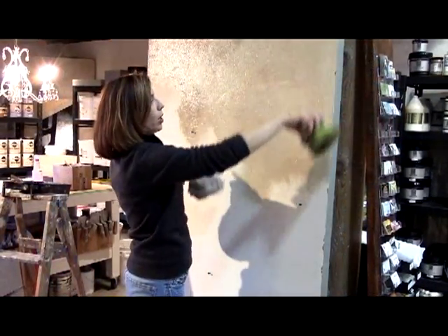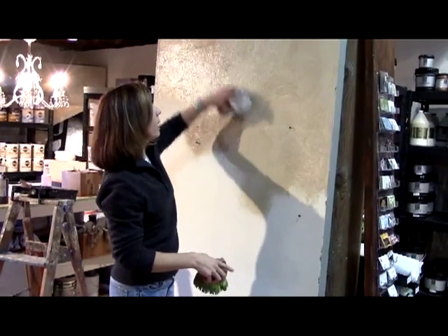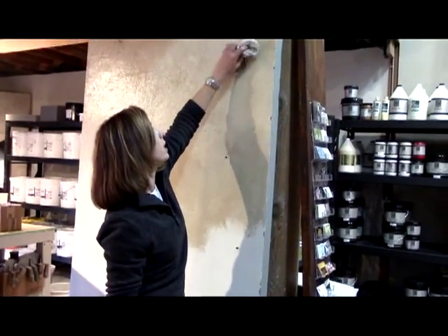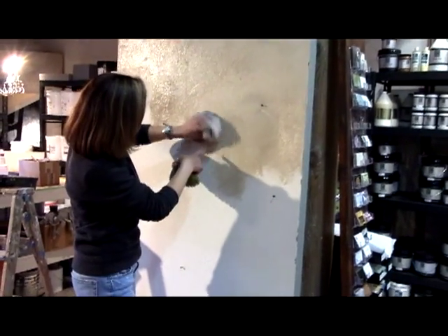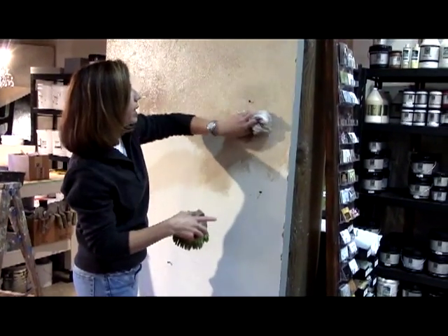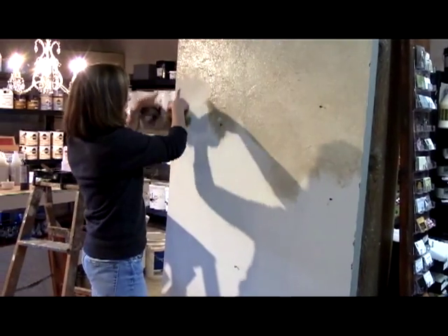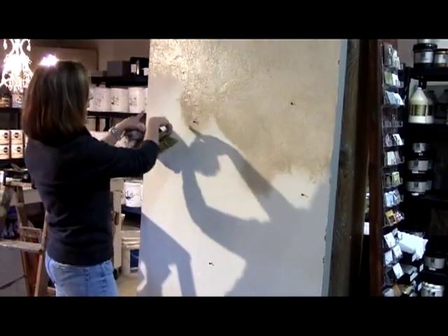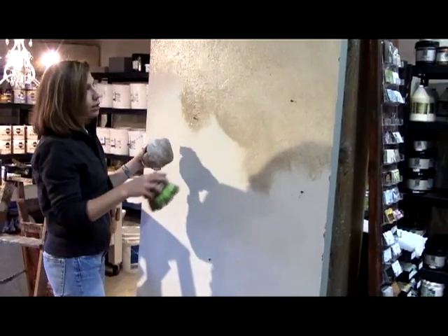One of the other things when you are creating your space that you're glazing is to make sure that it is a very organic shape. Take your cheesecloth and blend from your new spot to the older spots. As you come up to the edge, you don't really pounce yet because you're going to do it once you kind of bleed or marry the two sections together. Go diagonally, creating very organic shapes so that if there is any webbing that occurs it looks very natural.